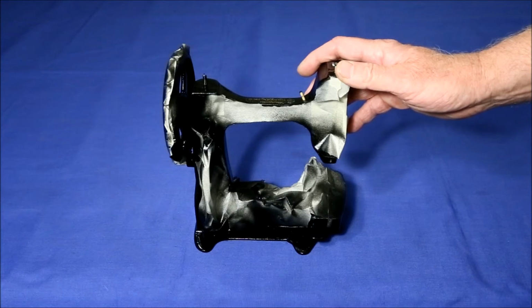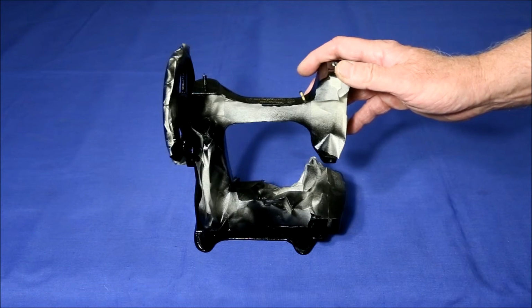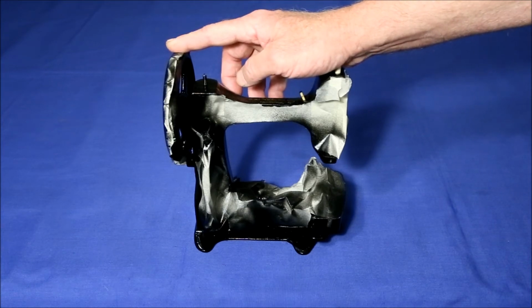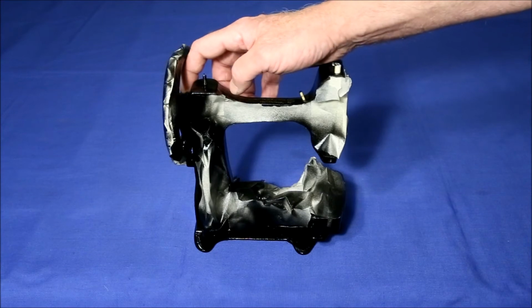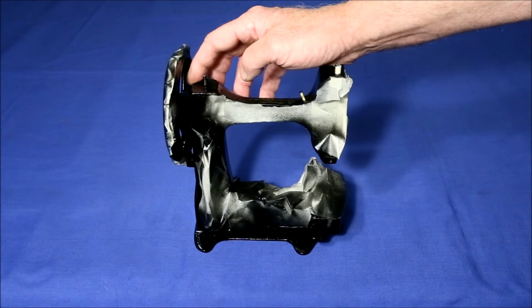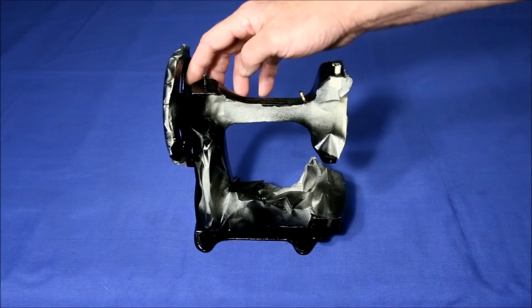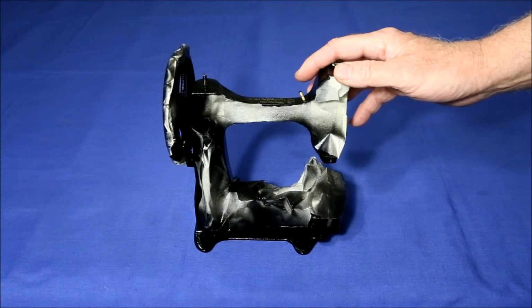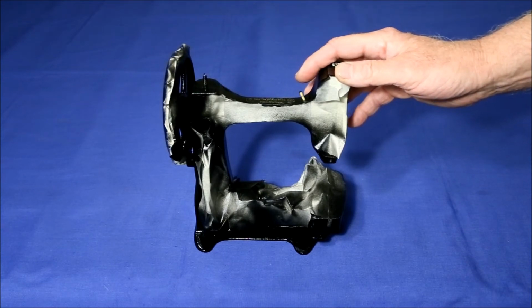The dangerous part is that taking antique sewing machines apart, even with the proper tools, which few of us have, runs the risk of breaking something, in particular the flywheel. If the flywheel isn't removed, caustic stripper is going to drip down the crack between it and the main body, where it can attack the main drive shaft. Even if that doesn't happen, you have a problem trying to get paint-saturated stripper out of a very difficult area. Also, 2K paints, even the rattle can versions, are extremely dangerous and require breathing masks.